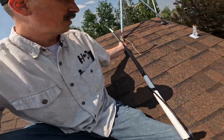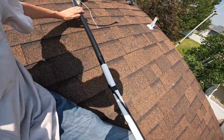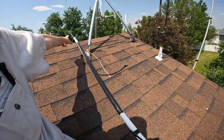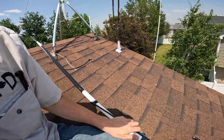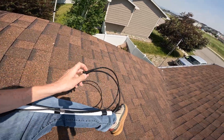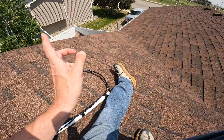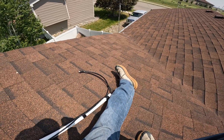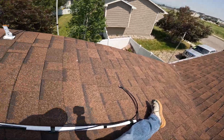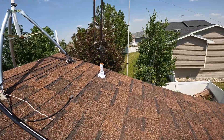Up here on my roof I'm crouched down to help block some of the wind noise. What we've got is the copper tape stacked dipole. I've taped over the copper — this is a dipole, and there's another dipole up there too. We have it harnessed together with some 75 ohm cable. The impedance should be around 36 ohms in theory, so then we'll go from 50 ohm down to the radio. We won't be able to get a perfect SWR without doing a comprehensive match, but the idea is to make it simple and show what can actually work. This is what I have on my Winlink station.